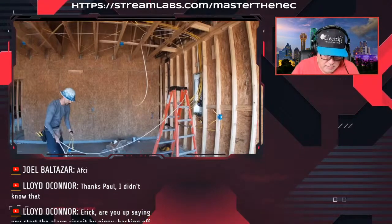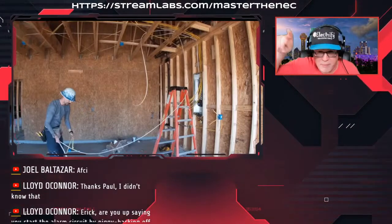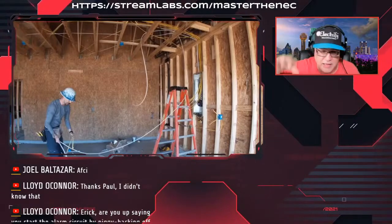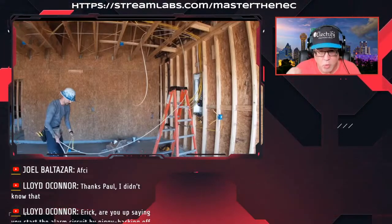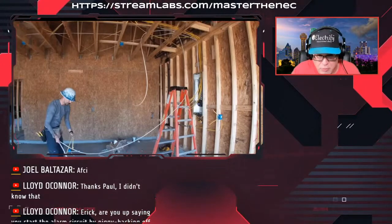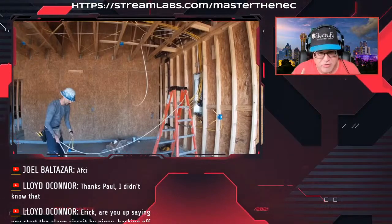20 amp, okay, at least one. Of course, we could take one home run and hit all the bathroom receptacles and loop them through and be done, as long as we don't cover any lighting on that circuit. But the code also gives us an allowance for doing what? Taking a branch circuit to one bathroom and hitting the lighting and the receptacles in that bathroom with that 20 amp circuit, as long as we do not leave that bathroom with that circuit.